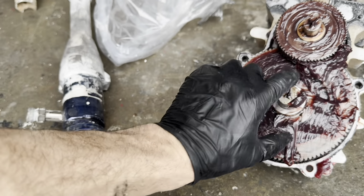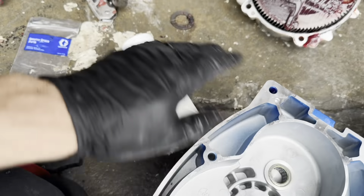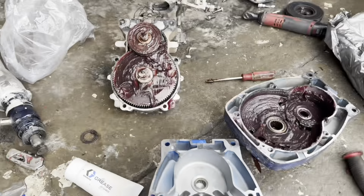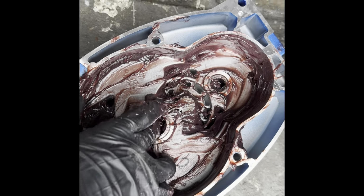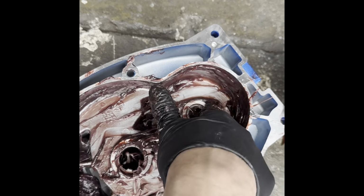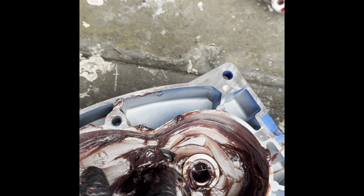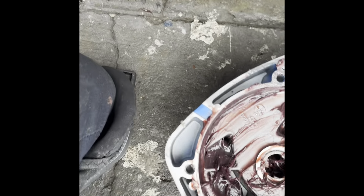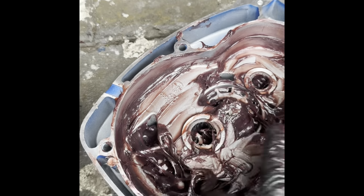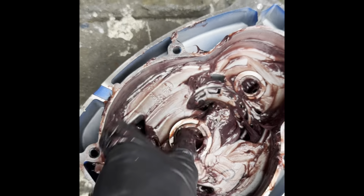Put that in there. Loop all this right here with this. Keep some of the old since I ran out. Pack it in that bin. Put some grease in the channels right here. When it gets hot, it's gonna wanna move around. So these channels right here, that's what the grease is for. Pack this bearing, don't forget.